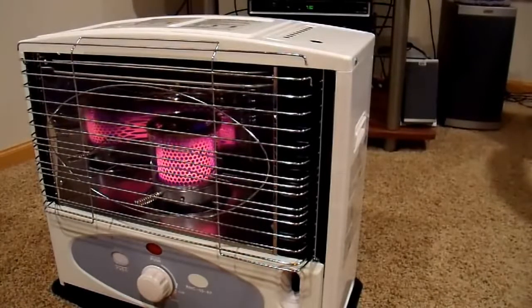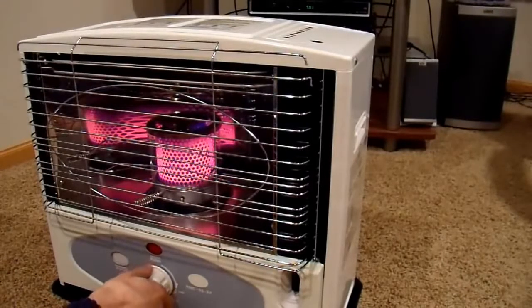I know that in my particular house here, just by running some calculations, as long as there's no carbon monoxide, and I'll be monitoring that, I can safely burn 1 gallon of kerosene and that'll make the carbon dioxide level about 2%. If I want to burn any more than that, then I'll have to worry about how many air changes per hour my house has. But I'm not going to worry about that just now. For now, I just want to see if this heater works properly.